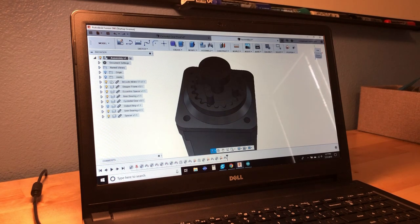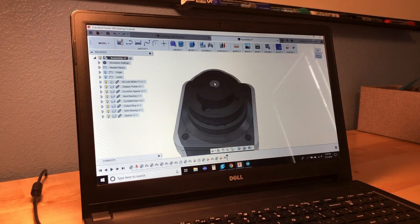Then, it has these pins that extrude from the gear face, which then fit into the output ring, which rectifies the rotation. So if this works perfectly, this shaft on the motor will rotate 20 times faster than the output ring.